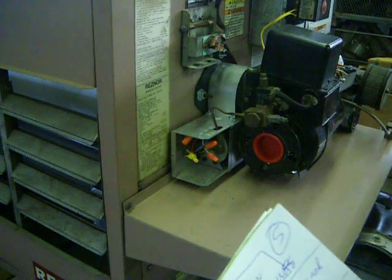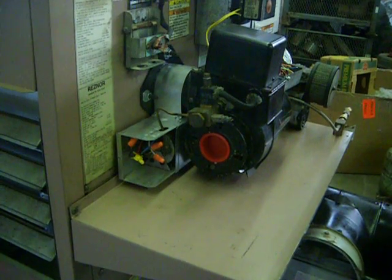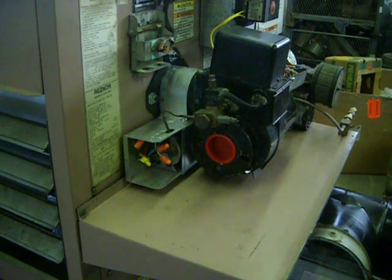Cut the insulation back from the stack plenty so you don't have a stack fire. Where the insulation is, especially with urethane insulation, cut it back 6 inches.